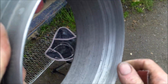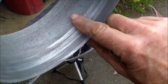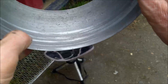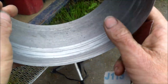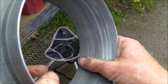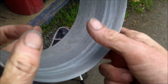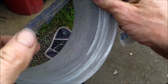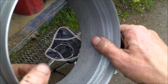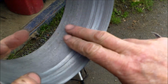Now for the liner. That one is slightly damaged. We see that it was touching a little bit here, not touching here. Most of the time the guys push it a little bit too far. They try to minimize the gap that we need, and it's touching. As soon as you have a little bit of sand, that will touch and it can seize the impeller in the liner.